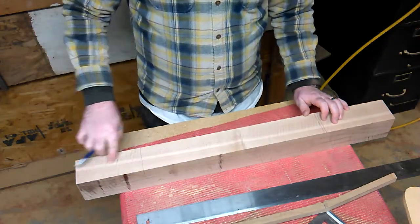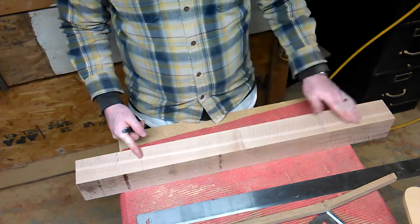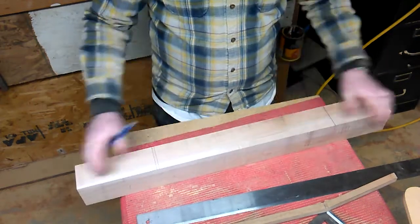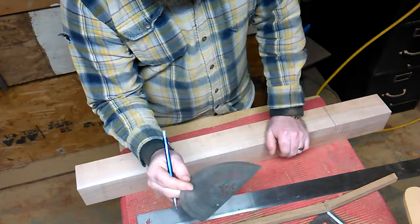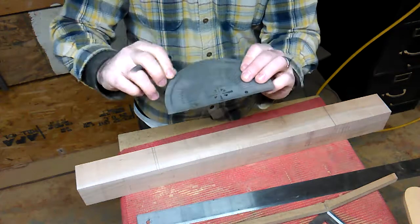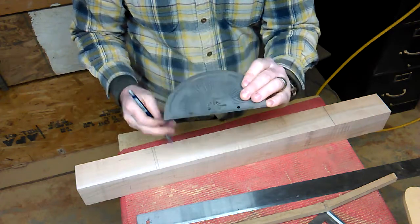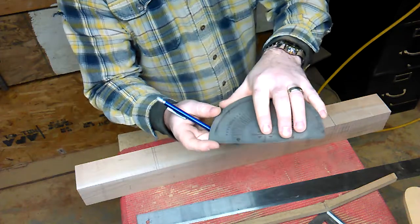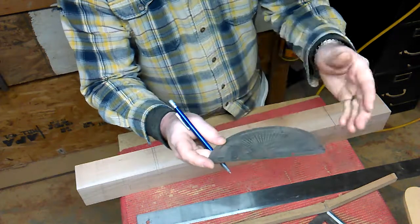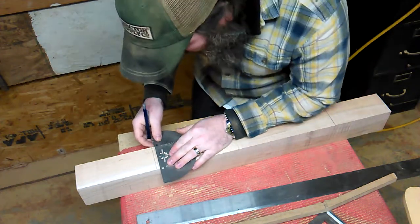Now we've designated this as our face. This is going to be our waist, and our heel will come here. This will get cut at a downward angle and this will become our headstock angle. Now that we've established this is our face and our fretboard will mount here, I'd like to come through with this — I love this thing. It's an Incra rule, it's a protractor, and it's thin so it's flexible. Part of the reason I like the 0.5 lead is this is laser cut so that a 0.5 will fit through the holes. All these little pinholes are that size so you can really precisely lay this out. It's got a center line and the measurement scale goes out — 1 inch, 1 inch, 2 inch, 2 inch, 3 inch, 3 inch, so on. If you can line up your tick marks on the outside, it makes it really easy to find where your center is going to be.